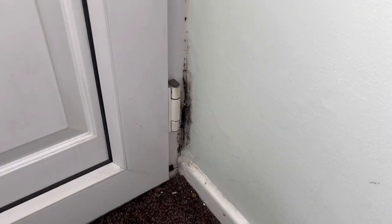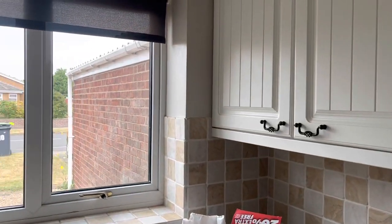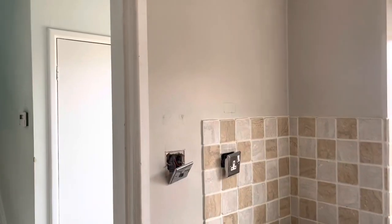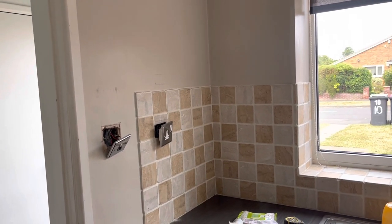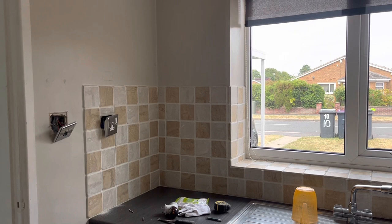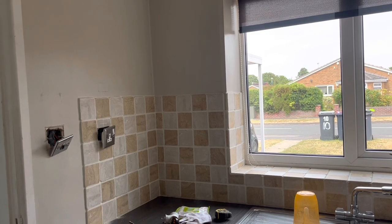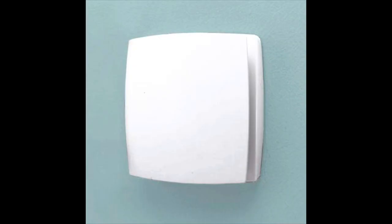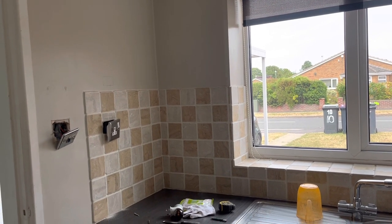Areas such as this would be cold simply because of the door down there, and also above the window just there. Where these cold spots are, the moisture is going to stick to the wall and cause condensation and internal damp issues. A remedy for that is to put in a constant trickle fan. You don't have to worry that they'll be expensive because they're constantly on — they cost about £1.12 a year to run and they're actually designed for the social housing sector. The manufacturers have made it so you can't see the fan at all; it's completely concealed and so quiet you don't know it's on.